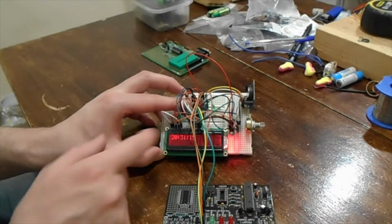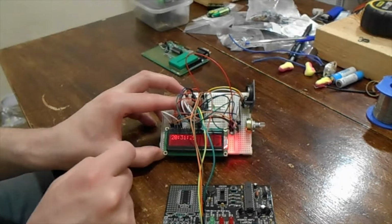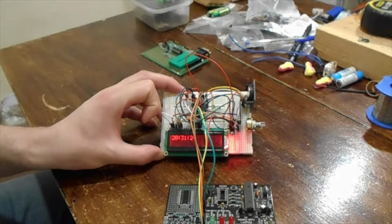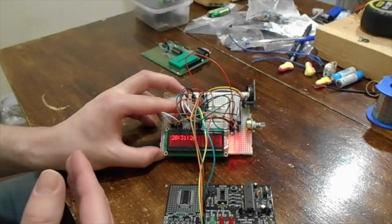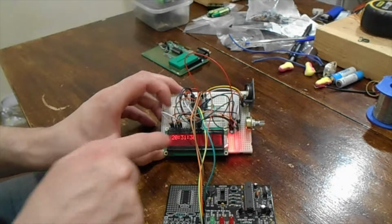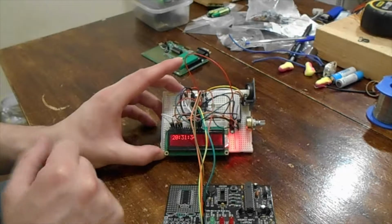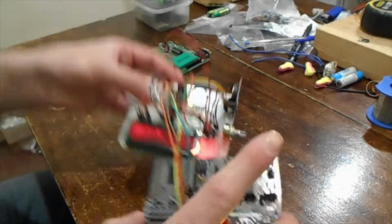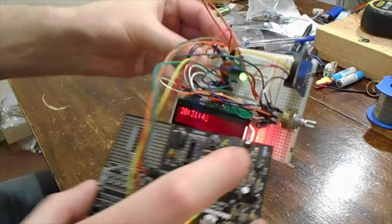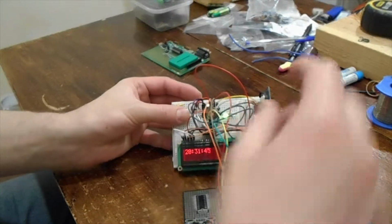So basically, if you want to set it bang on 8:30, at 8:29 and 57 seconds you'd hit program and it'll be programmed. Now, the reason you can then remove the programming settings and put the display driver and fetch settings in is because the chip itself isn't telling the time. It's executing a piece of code which interfaces with this module here with the battery on it, the DS1302 RTC real-time clock module.